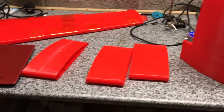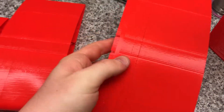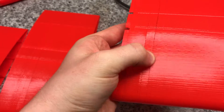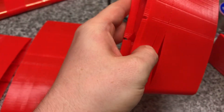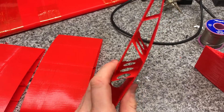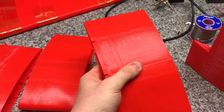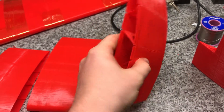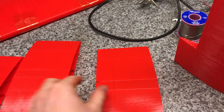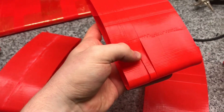To print these, I've actually done quite a few iterations. You can see the first one here was printed at fast speed, and you can see the layer separation — it's not going to be very strong. I experimented with different cross members. This one here performed better this way, but the single layer let it down. This next one was the other half — even faster print speed, and you can see it's even worse.